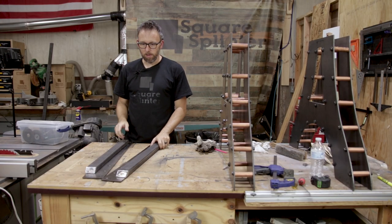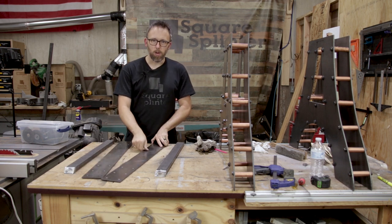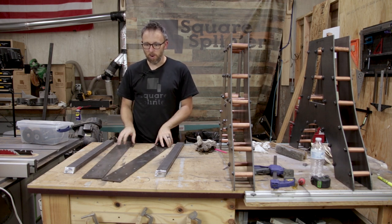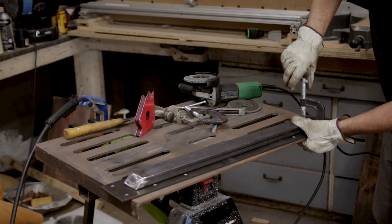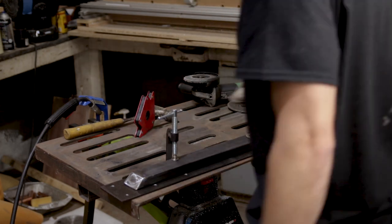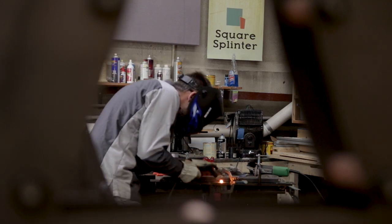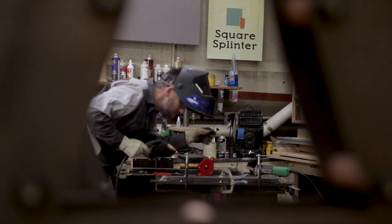After figuring out carefully where I wanted to put these holes to stabilize the top, I had originally thought this flat plate here would go on top of the legs to support the top, but it turns out this 3-sixteenths plate is just not quite thick enough — it's not staying straight. So I had the idea of putting these tubular supports on there. I welded the caps, ground everything down — a lot of grinding. Now I want to weld those onto these plates to be the underneath supports, hidden by the legs, making it super strong so the tabletop will never bow or move.